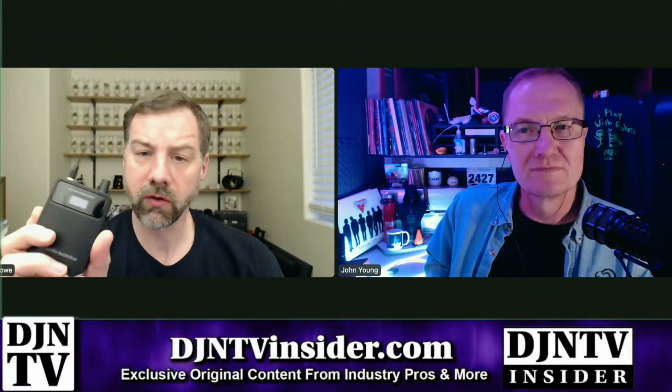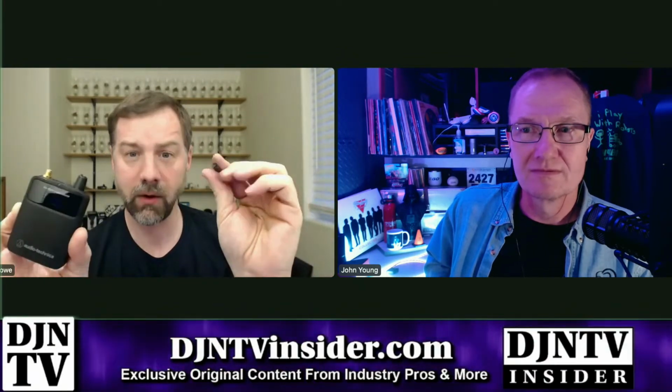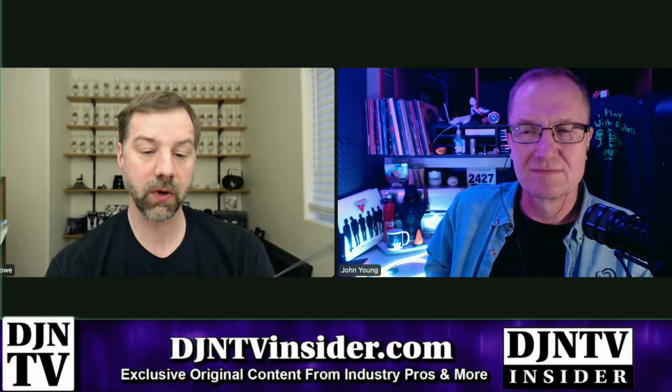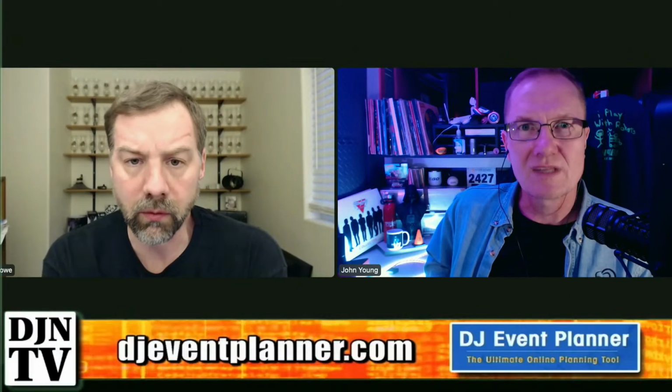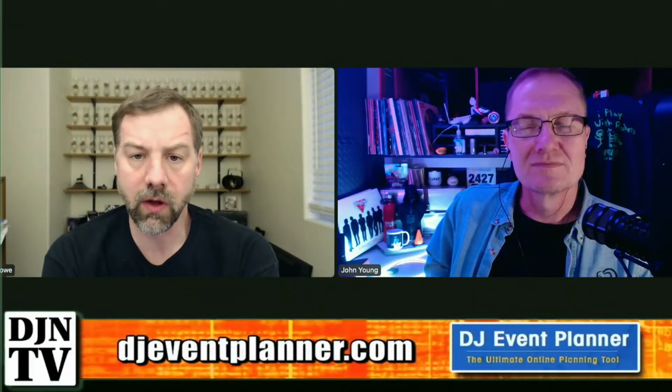So it depends on the pack, but you might say, well, this pack only has one antenna. Speaking of which, another little plug for AT here. It's replaceable. You break an antenna, no problem. Easy to just put a replacement on. Keep spares in your kit, even if you're really accident prone. Some receiving packs also make an antenna out of the headphone cable or the lav mic cable, or the output cable on a receiver body pack. That's sometimes how they achieve back some of that diversity on a pack receiver.